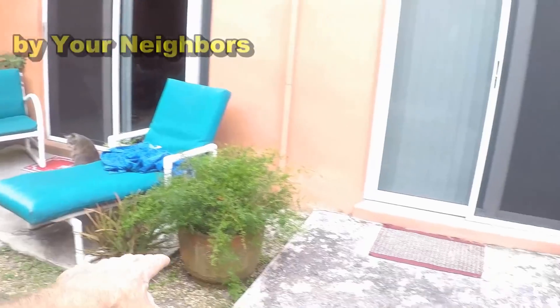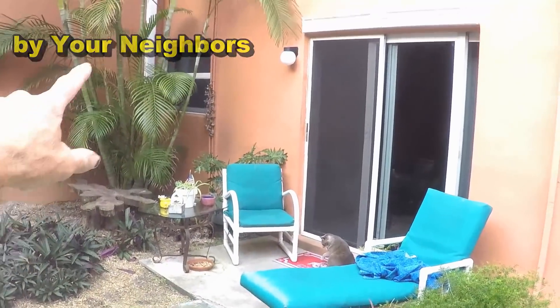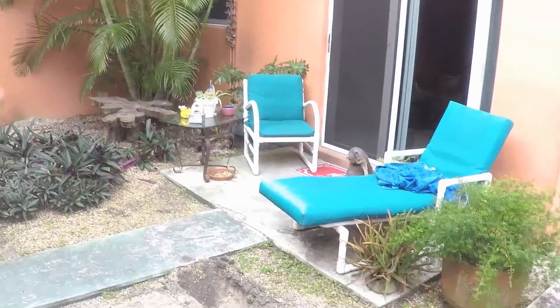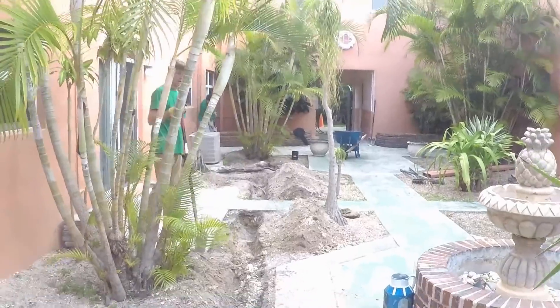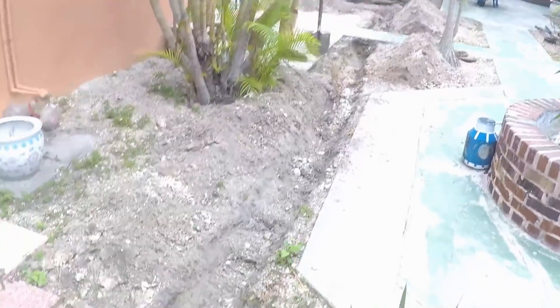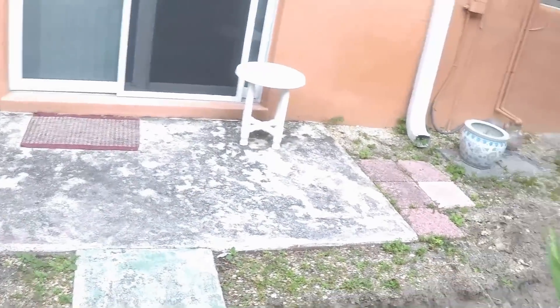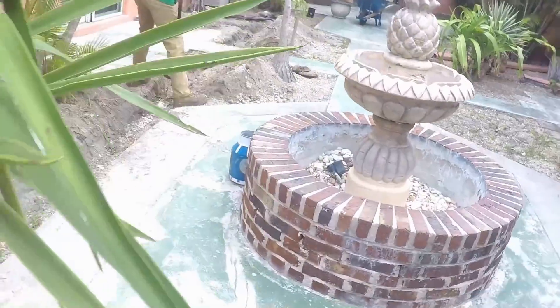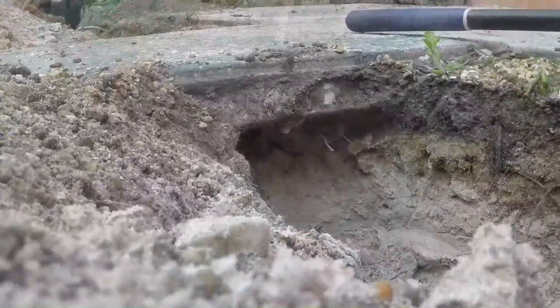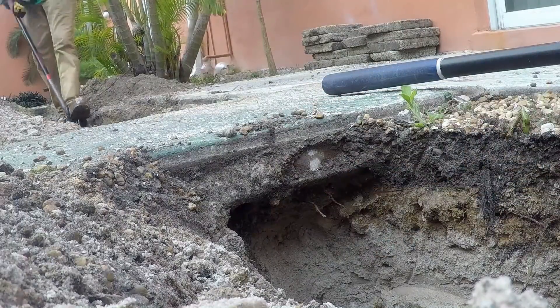We left an estimate to replace and put in new footer pipe along here, but that's costly. So instead we're going to put in downspout drains. You can see the downspout in the corner behind that palm line — it's going to come down, trench all the way over to where Chuck is, and a sump pump will be down there. We'll also put some catch basins here to collect this water, and then the pump will lift it up and send it out. We also have a couple of sidewalks to tunnel.